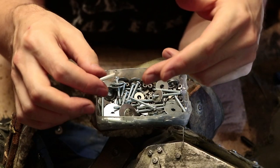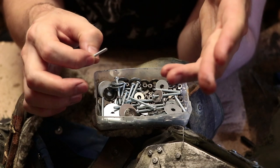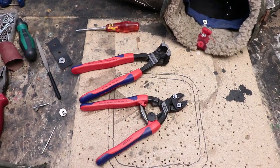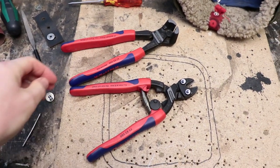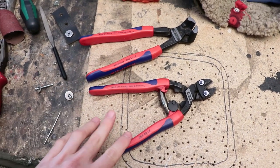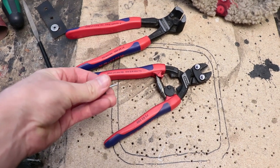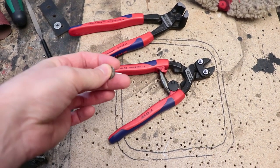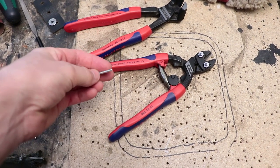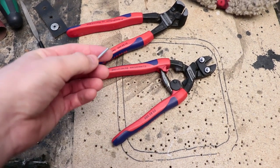Chris from Red Roach Gear uses 4mm ones — those are, in my opinion, a bit of an overkill, a bit harder to cut, and weigh a bit more. But 4mm works for him just fine. I myself have not worked with 4mm bolts consistently, so I cannot tell how these cutters will do with them. I imagine they should do fine, even if a bit more difficult. I do not see any reason for myself to go above 3mm, and I would also not recommend going above 4mm — I imagine that to be really unnecessarily difficult. My recommendation is to stay as close as possible to 3mm.